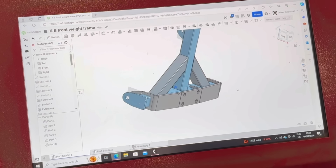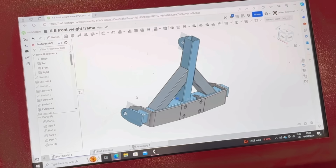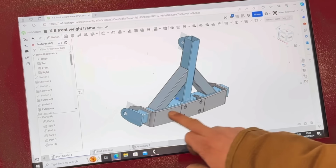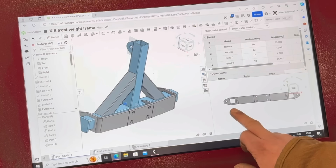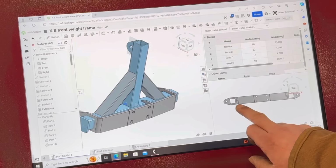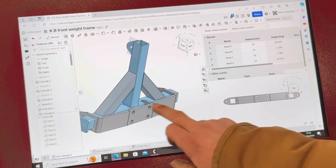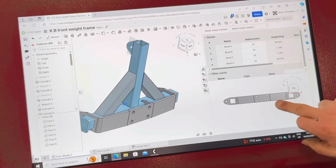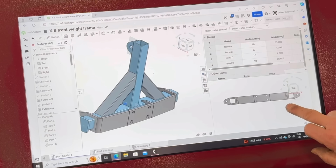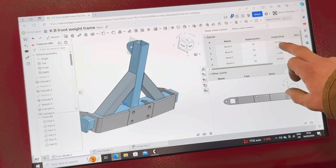What I've been working out this morning is how to use a sheet metal tool. It's taken me a fair while to work it out, but I've got it worked out now. So this piece here, I can cut it out all in one. That's what it looked like as a flat piece with all the holes and the squares for the box section to go through. Then when I cut it out, I can mark where my press marks need to be with my engraving head, and it also tells me what angles I need to press them at.